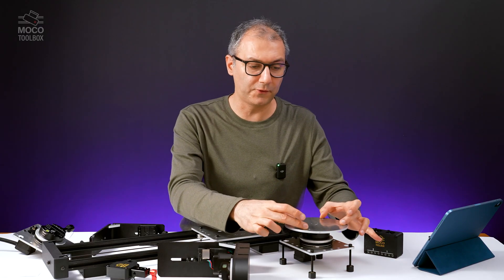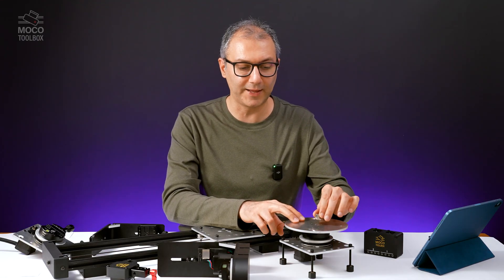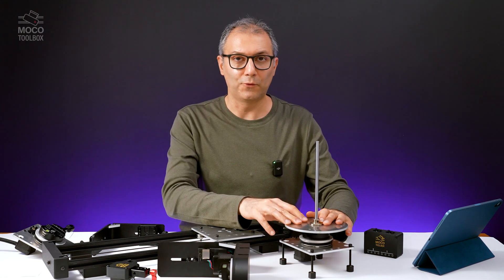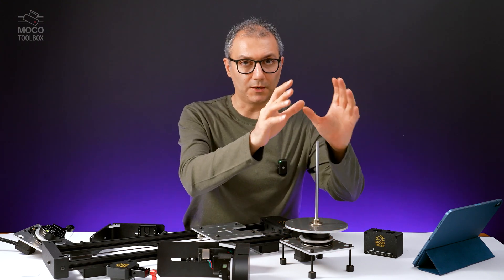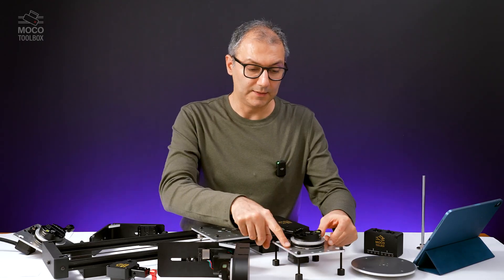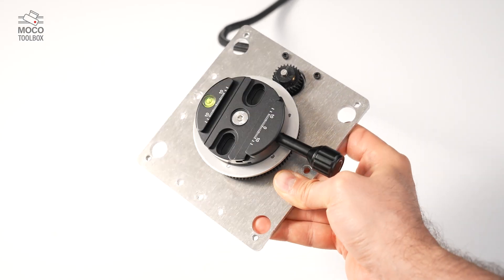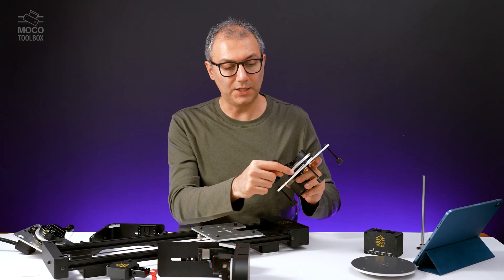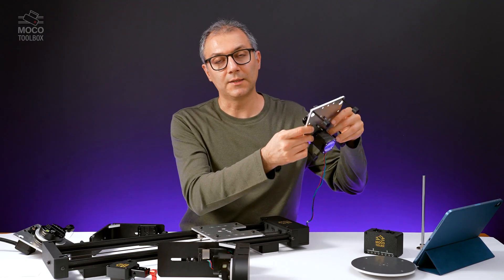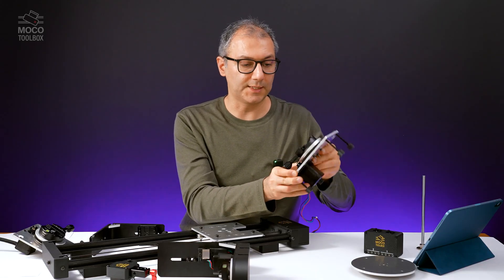We have four M5 threaded holes and four M3. The M3 holes are compatible with a flange coupler, so I can attach a coupler and, for example, add a rod for any purpose — maybe putting something on the very top without having the base visible on camera. The legs are adjustable and the mounting holes are all compatible with metric aluminum extrusion standards, so these are each 20 millimeters away from each other, allowing you to easily mount it using aluminum extrusions to any rig or structure on your set.